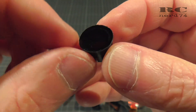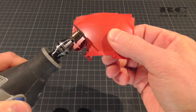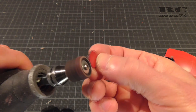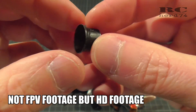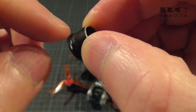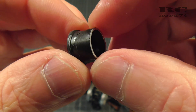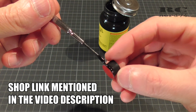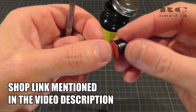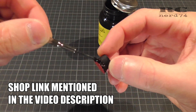Next step is to cut down your glass to the right size. I highly recommend that you cover both sides of the glass with some tape just to avoid scratches during the cutting and sanding, so you have a really clean glass after all the work and no scratches which affect your footage. I prefer a shape that is a little bit bigger than the aluminum tube because it's easier to glue onto your tube since there is more surface area. The best experience I had is with plastic dip liquid tape, because it's removable — so if you did something wrong you can take the two parts apart, clean both, and put them back together. Unlike glue, which cannot be removed once it's on the glass.